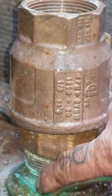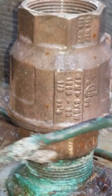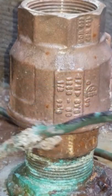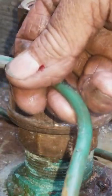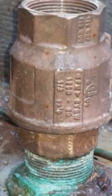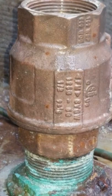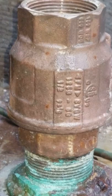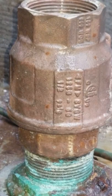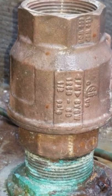I've got a little electrolysis going on down here, and that's because this wire right here is the grounding wire and it's off. This is part of the reason why you have to have grounding wires on everything on a boat — very important. If you don't do it, all your parts will turn green and nasty and just fall off your boat.